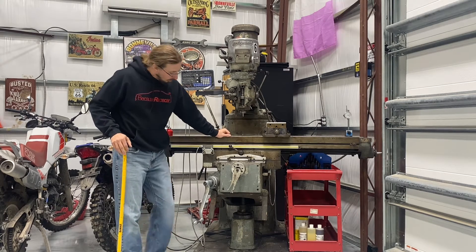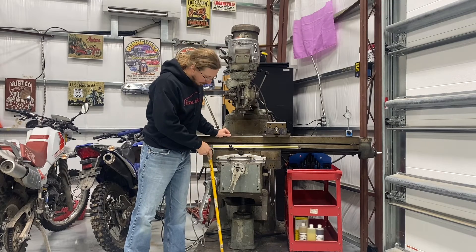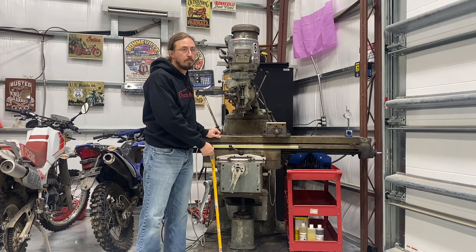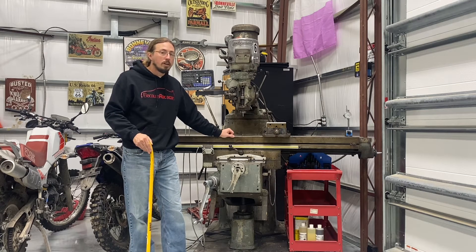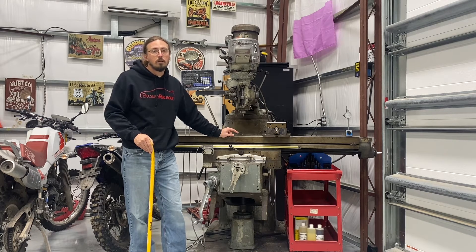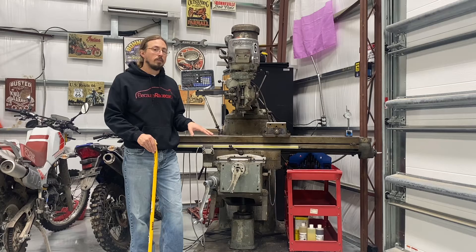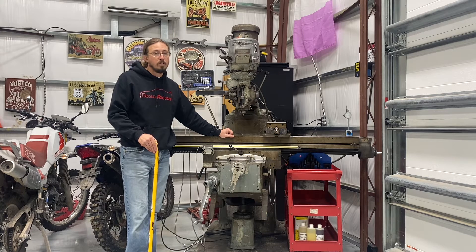A couple of tips: when you look around you'll see that on this mill and others there's a lip around all four sides. Get a big pry bar and you'll be able to get it far enough up to put some rollers underneath. I used iron pipe as rollers. Remember, this thing weighs 5,000 pounds — a Series 1 at 2,000 pounds will work easier. The pipe actually bent, but it still made things easier to drag on and off. Having a little bit of oil on the ground can help too, as it'll make it easier to slide.